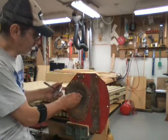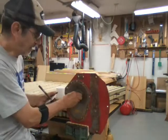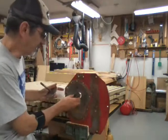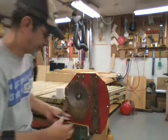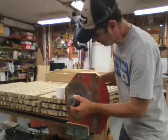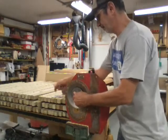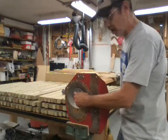Turn those slots into position. This bushing pushes in all within about three-eighths of an inch because the bushing has a lead on it — that's where it's turned down smaller so it'll start in easier. Orient your slots, kind of shove it in there. Put your puller back through from the other direction. Now you want to put the plastic spacer on the opposite side, then your big plate, and your four or five oily washers, and get the nut started.